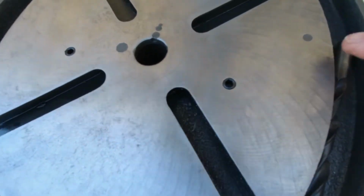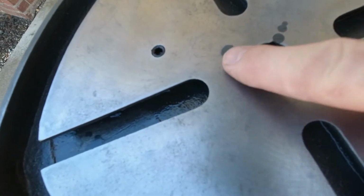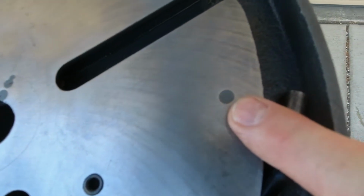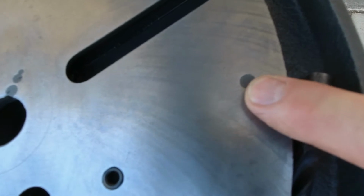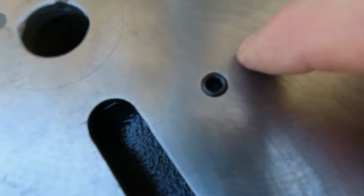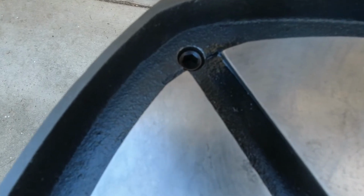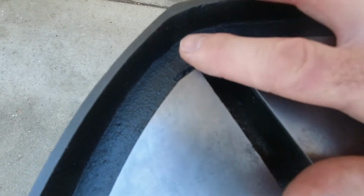These were, again, the original couple of drill bits, and I did fill the holes that didn't go all the way through. This one actually did, and I don't think I'm going to use that, but what I did put in these 3/8 inch holes was a hex bolt. So I did that in both, as well as that is a drain plug, and that's a 5/8 inch 11 pitch thread drain plug. So that was built into the table.